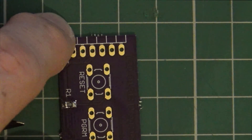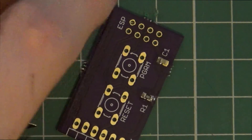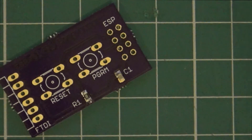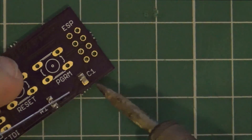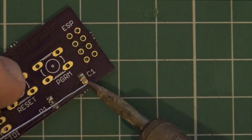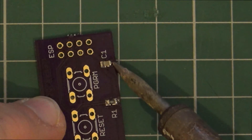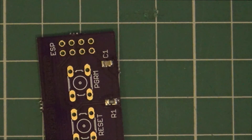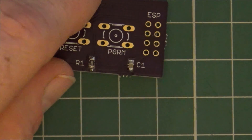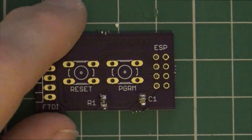I've managed to do that off-camera, apologies. That's a bit better. Now you've just got to be careful because what it'll do — like it did with the resistor — is transfer the heat through and reflow the solder on the other side, and since it's so light it'll move about. Be careful. It's okay, it's not perfect — I'd prefer that capacitor slightly further up — but it's a good connection. That'll do.